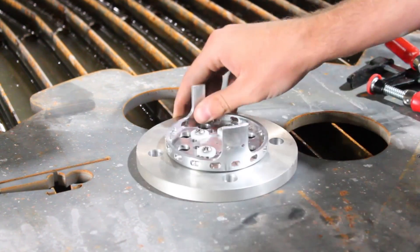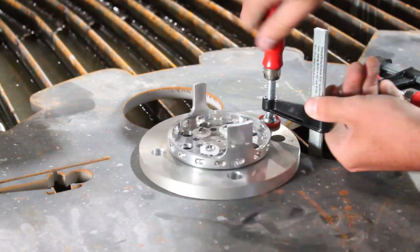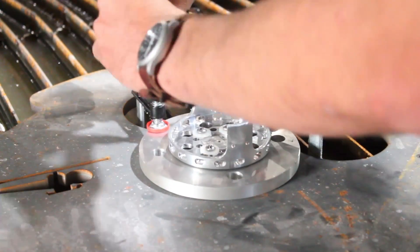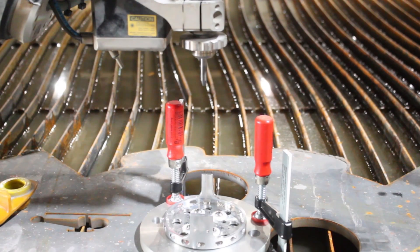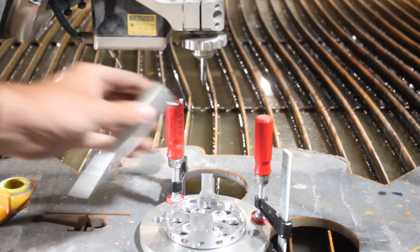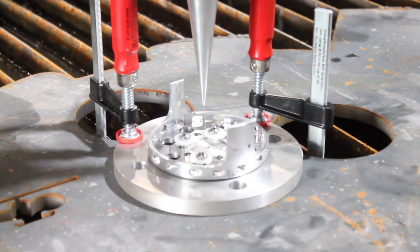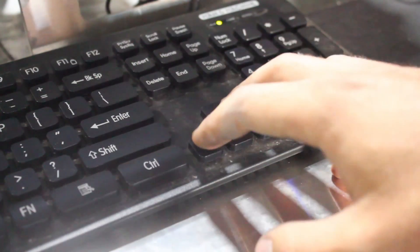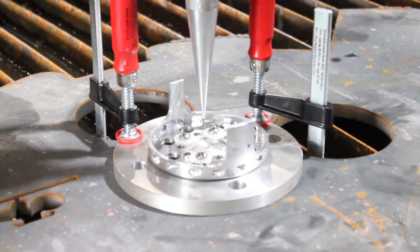To mount the reel to the water jet, I hooked it back onto that little faceplate I made for the rotary table and just clamped it onto a piece of scrap steel to give me a surface. I turned a small tapered cone to fit over the end of the water jet to help me line up where zero-zero home should be, directly over the center of the hole. From there I just put the machine in low speed jog mode and carefully lined it up right over that pilot hole.